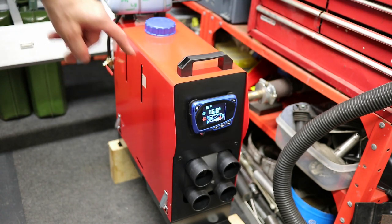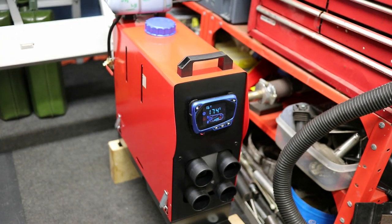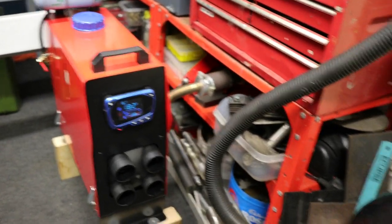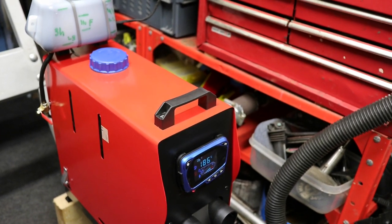What I do is run this for one hour until it's really hot, then switch over to the bio-fuel blend and put it on level three, which gives me four hours. That's perfect for me. Starting on clean diesel means it starts reliably — if you start on the mixed fuel you might get smoke. The exhaust goes through the wall and as you can see, it's clean, no smoke at all, no fumes. Right now it's at 186 degrees.